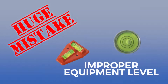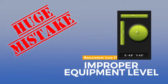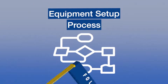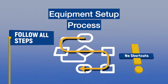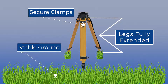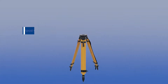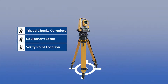One of the biggest mistakes a surveyor can make is not leveling their equipment properly. Unlevel equipment can lead to measurement issues that stack up later. Do the entire setup so you can determine why it is unlevel — don't just re-level it. Make sure that the tripod is on stable ground, check the clamps, make sure the legs are fully extended, and ensure it's not teetering.